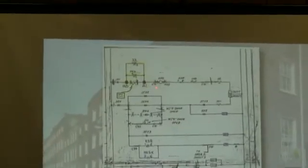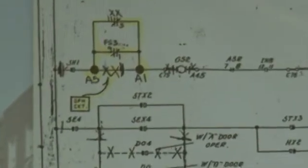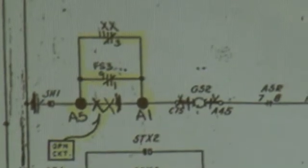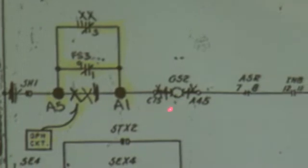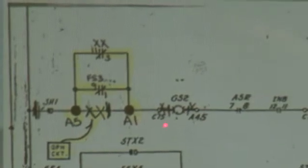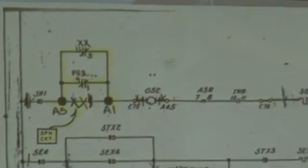So if Charlie, say, 75. Is that 75? Yeah, looks like 75. Yes, don't get old. My cheaters, I can't read that. Anyway, take all the controller wires off C15, butt splice them together, run them to Alpha 5, and a new wire from Alpha 1 back to C15. By doing that, you've isolated the system and you know that you've moved everything out that has to go.